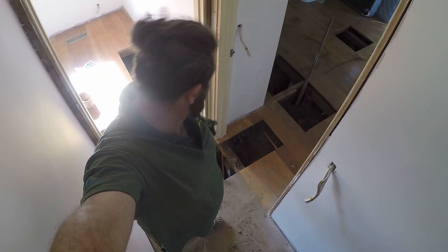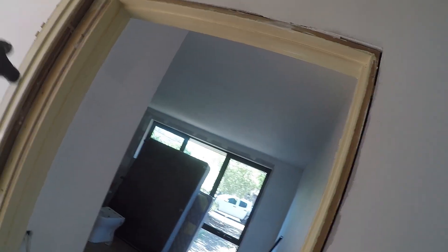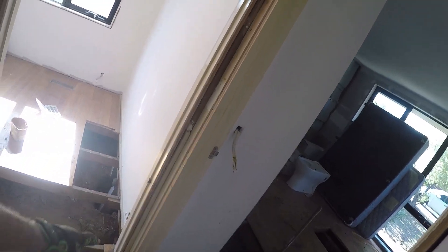You'll notice that there are a couple of stumps closer to other stumps. This point here — I've got two stumps right next to each other because this is actually a load-bearing point in the ceiling, and it's a doorway for two doors as well. So if this shifts, the doors will be out, the floor will be out. This is a major position where we need to make sure that we pick up all of that weight.